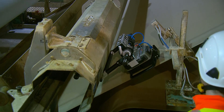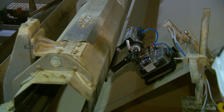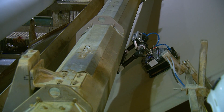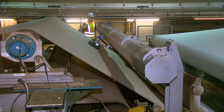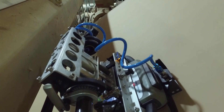For a cross-direction profile, the shuttle first moves to the edge of the felt and stops. Then the measuring unit moves into contact with the running felt and the reading starts. With a constant speed, the shuttle now begins to travel across the machine from the tending side to the drive side. Due to its fully automatic process, any outside interference from the operator is prevented, and thus reliable and repetitive readings are achieved.